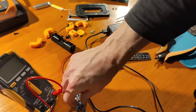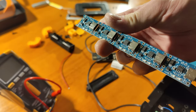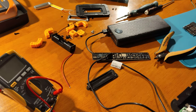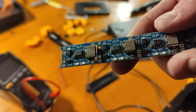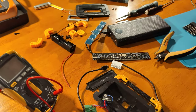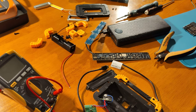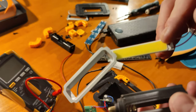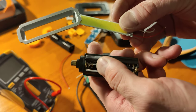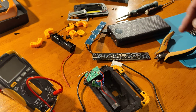These are the new USB-C charging modules I got - just one amp, but they've got your input, output, battery connection, and USB-C port, with the TC4056A and a DW01 on the bottom left as expected. These are good and safe and cheap as chips. This device is cheap as chips and not good and not safe. Not worth $15 - maybe two bucks on eBay. The useful parts out of it are: this AAA adapter which is useful, the COB chip which I'll use for something else but is maybe a 30 cent COB, and the case. I hope that helps someone understand what to look for in no-name brand stuff on eBay. Enjoy.